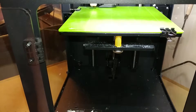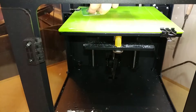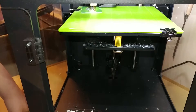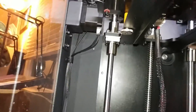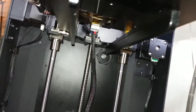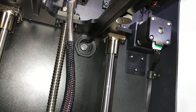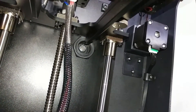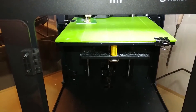Now go to the back left corner and do the same thing with the card, except this time you don't spin the wheel - you use the adjustment bolts. There is a bolt in the front for your build plate, another one in the back, and another one on the other side. You'll need to adjust them to get the right build plate height.